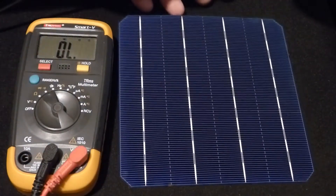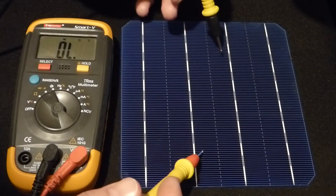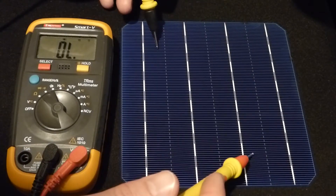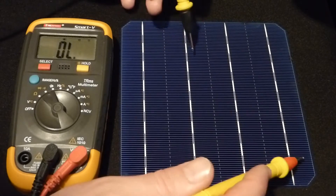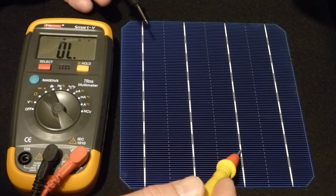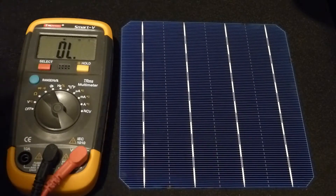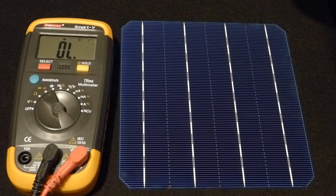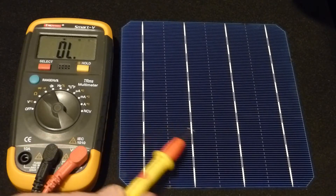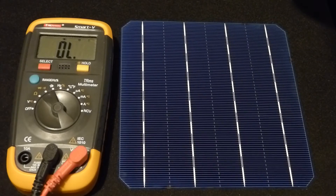It's really easy to make a connection on the back. On the blue side, if you touch any of the blue areas, those are not conductive when taking measurement readings. Your connection has to be on these white areas. So the whole back of these cells is conductive, whereas on the front, it's just these white traces — the blue areas are not conductive.